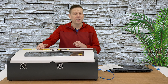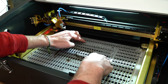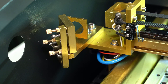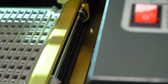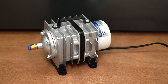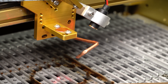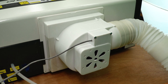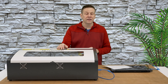Cloudray builds upon the basic K40 machine by using a high-quality laser tube. The work area has a cast aluminum bed with a removable tray for the built-in clamp system. There's top-notch machined aluminum brackets with a really nice gold anodized finish. Linear rails throughout for precision control of the laser head. The Cloudray machine includes a really good air assist pump, an off-axis air nozzle, and a high-flowing exhaust fan. I'll provide a link down below if you'd like to know more details about the Cloudray K40 machine.